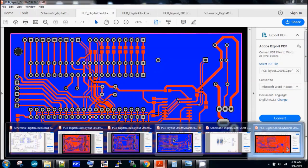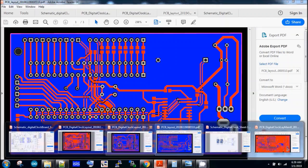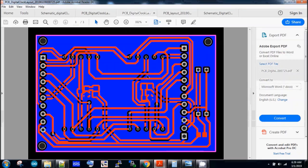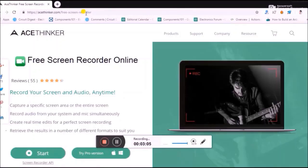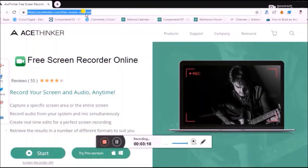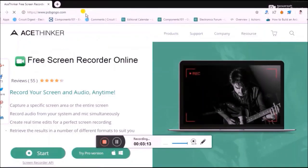This is the bottom layer of the controller module, and similarly for the display module here is the top layer, and there is a bottom layer as well. From here you can convert the PCB layout into a Gerber file — all PCB designing software will have an option to generate a Gerber file — and then use that Gerber file with your PCB fabricator. This complete project was sponsored by PCBgogo.com, who provide highly professional PCBs at cheap prices and ship directly to your home.